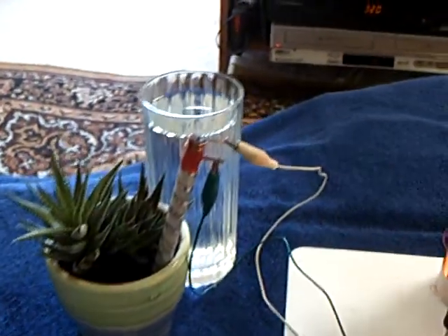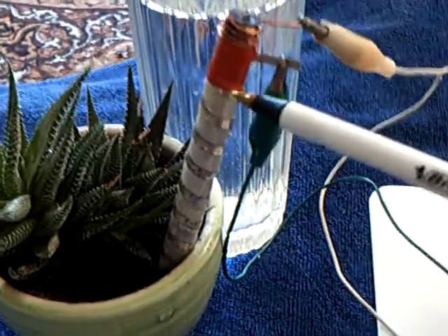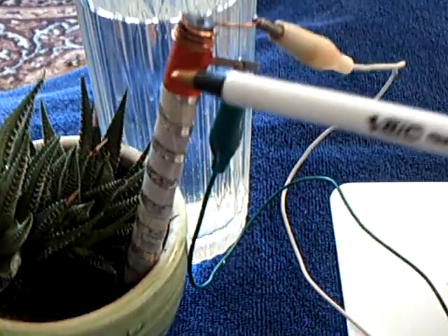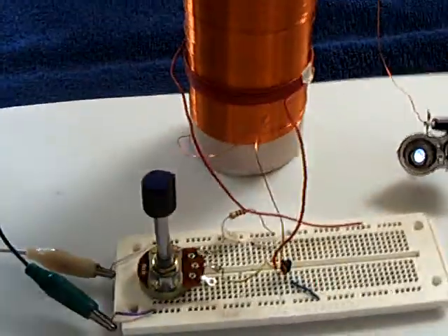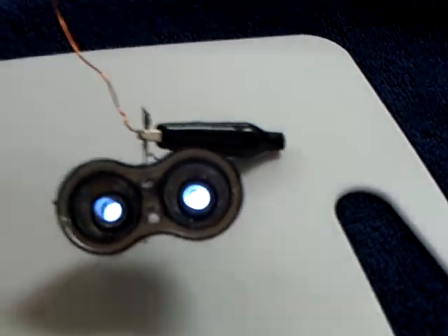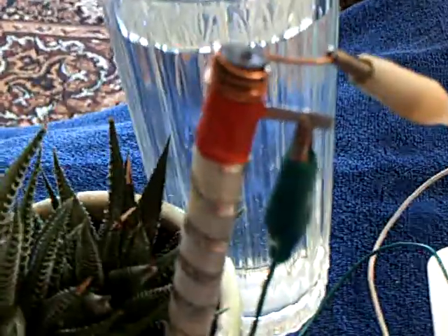You guys are gonna love this. This is the barber pole battery that I showed in my last video. It's Laser Saber's carbon rod, or graphite rod, with magnesium ribbon wrapped on it. I had a lot of fun playing with this and found out it would run a Slayer exciter — the LEDs are on right down there. This is in full operation, coming off about 1.4 volts at about two or three milliamps.